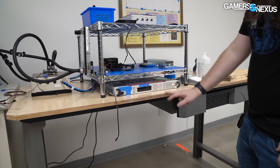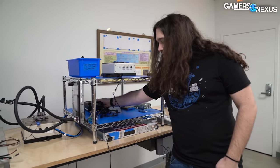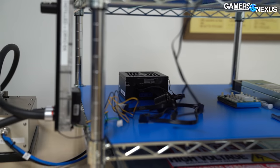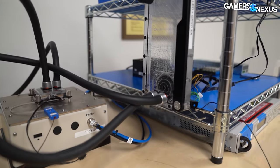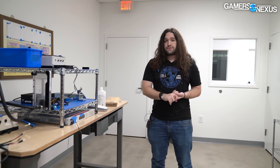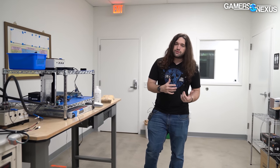We turn it on up front and run it for the power load we want — it's all configurable through the screen. The power supply is just a normal ATX unit jumped with a 24-pin bridge, which gets the water flowing. To be clear, all of this is only going to create one or two charts in the fan reviews. Thermal is not the key thing — we're still focusing on PQ curves and resistive testing impedance — but this component lets us relate performance back to real-world use.